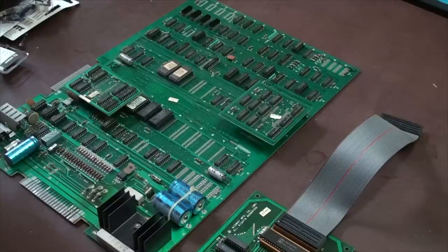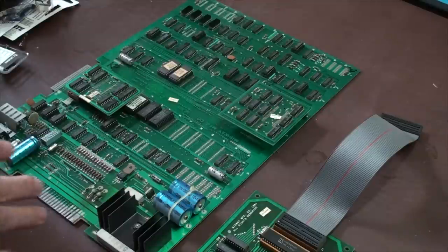So you do the first thing, boom, wires, ribbon cables, loose connections, most obvious, right? This is just done by visual inspection. You don't need any special tools for that. After that, you start checking things like power supply. Make sure that the game is getting the power that it needs. Like I said, I'll show you how to do that. After that, as long as that's working, then you can start going into the meat of this stuff.